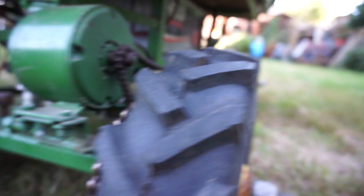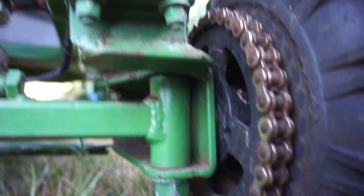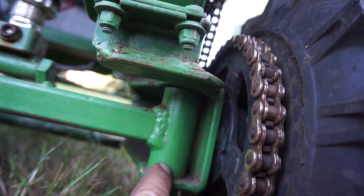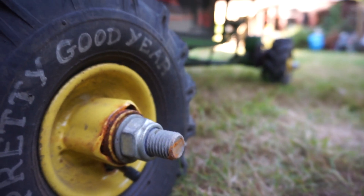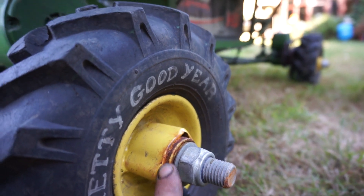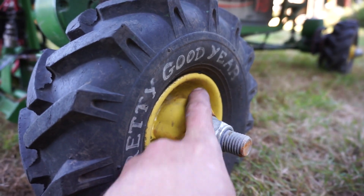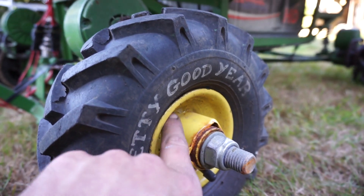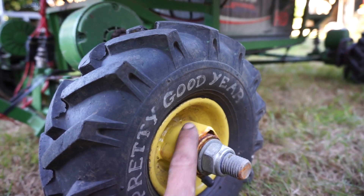The front and back are pretty much identical, apart from a couple of little spacing differences. The front axle is just a piece of box section, and then you've got a big boss here with a bolt that runs through it like a kingpin. The actual spindle that runs through there is another bolt — an M20 bolt — simply because I found some bearings that fitted on the M20 bolt. They also fitted in a piece of PTO tube — a tractor power take-off tube — which welded onto these wheels.